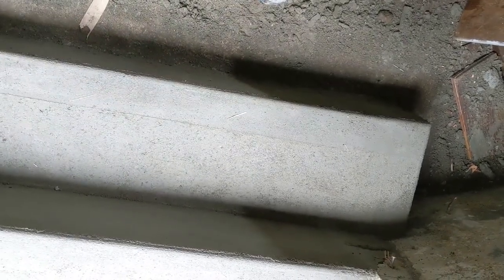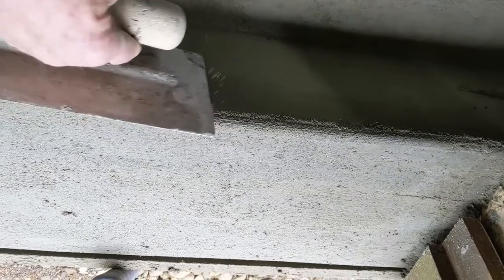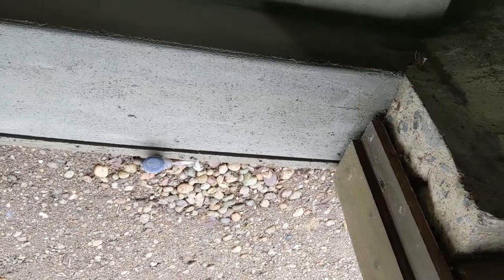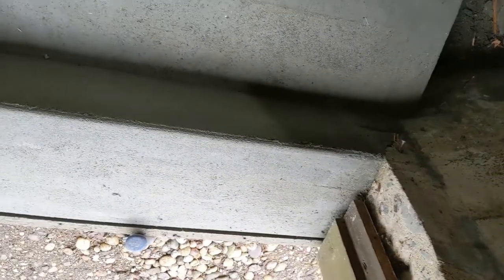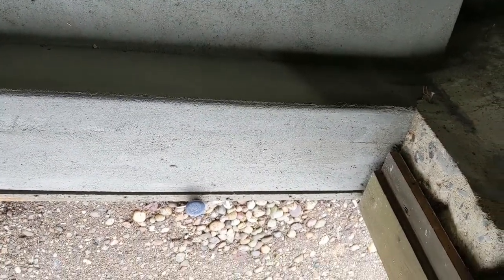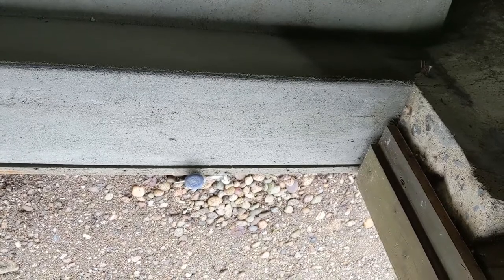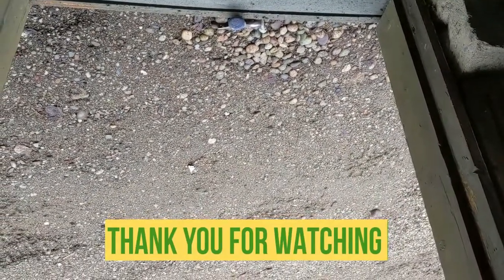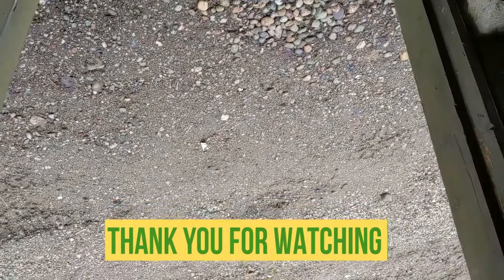Yes my friends, so here I just removed the form. You see how it looks - the corners are all a little bit rounded. You can trim a little bit if you guys are not happy with something like this while it's still fresh - just clean it with a trowel or a knife, a taping knife or something like that. That way it's easier to do it now than to let it harden and try to do it later with the grinder. This way you have it soft, no dust, nice and easy. So this is about it guys, if you have any questions let me know, put your thumbs up, and subscribe if you're not subscribed yet if you want to see more content like this. See you soon!